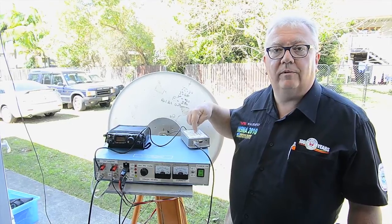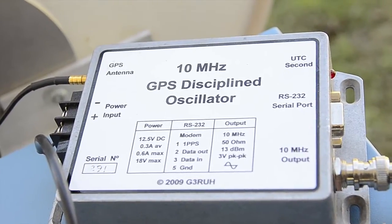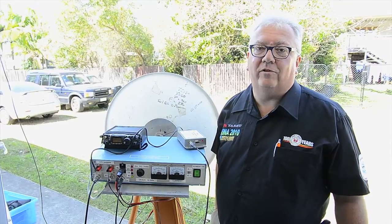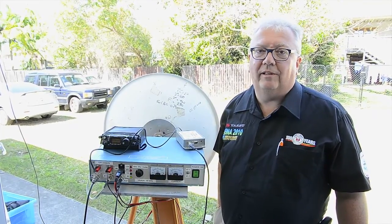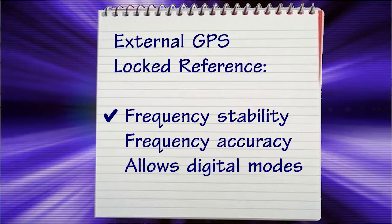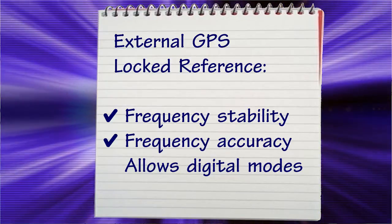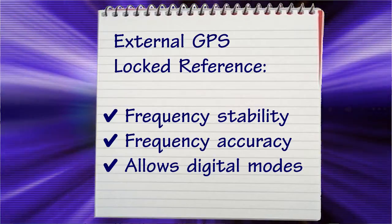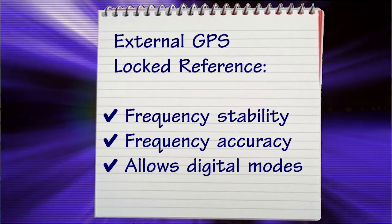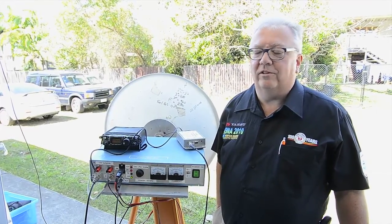This is a GPS module that came from England — it's commercially available, made by a ham over there. It gives you a nice stable 10 MHz reference, and the DB6NT modules have that facility. They have their own oscillators and if you just run them up they work pretty well, but if you want more stability you just plug in the external 10 MHz signal and they switch over and use that. It takes out the big variable of not knowing whether you're on the right frequency, and makes it possible to consider things like digital operating, various weak-signal modes, aircraft scatter, and other propagation modes with good potential for range.